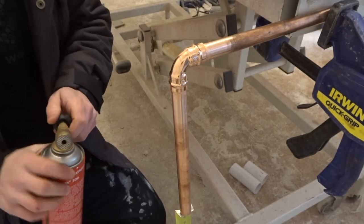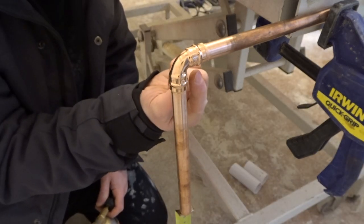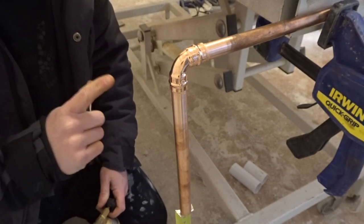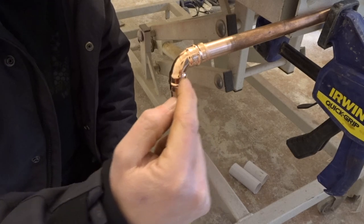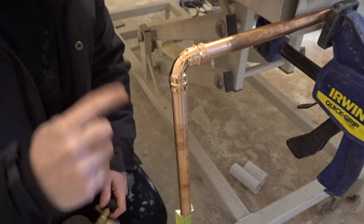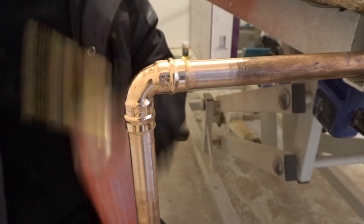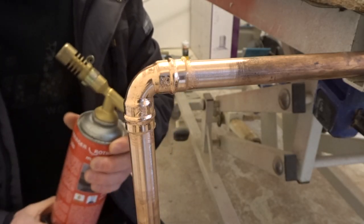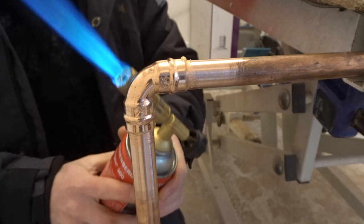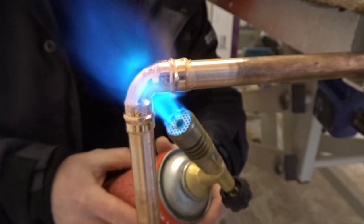Now our pipe's prepared, let's go ahead and solder this joint. When you're soldering, you want to make sure you solder from the bottom of your pipe. If you heat up the bottom of the pipe, heat rises and you'll get a more even solder joint. The other reason is capillary action — if you were to heat up the top of the pipe and the bottom was cold, the solder would run down but it wouldn't be hot enough to do its job. Heat it nice and evenly. Also, when not using map gas, give your bottle a shake, otherwise you can get some pretty big flames.